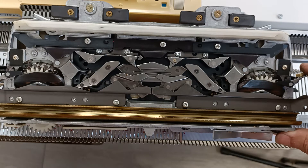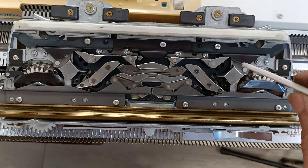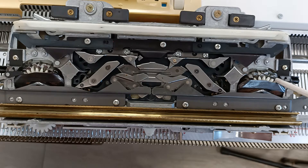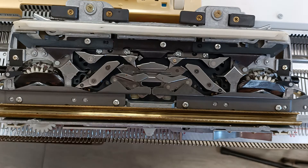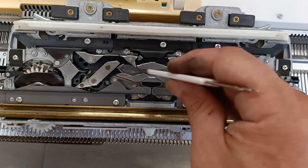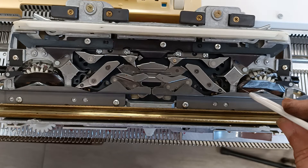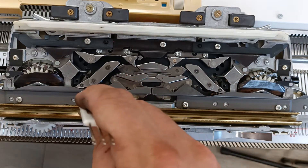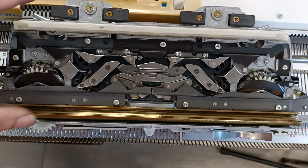But if I flip this lever, it makes the needles pass over this drum here. You can see that some of them will hit the bits that stick out and be pushed forwards, and some of them will not and will go backwards. Now, the forwards ones get pushed down, pick up the stitch as normal, get pulled back as normal, and knit as normal. The ones that go backwards still just come down here, pick up the stitch, pull the stitch through, and go out normally. So in this particular setup, whether the needle is forwards or backwards, it will just knit normally.